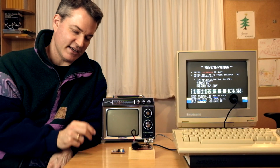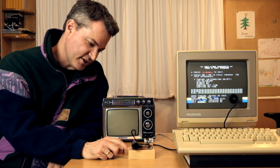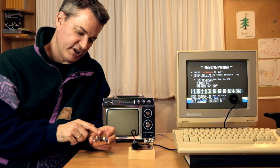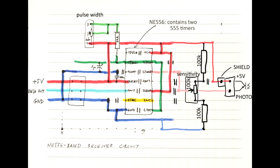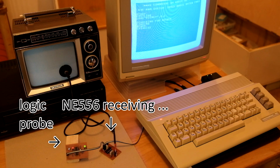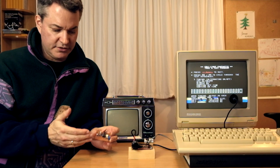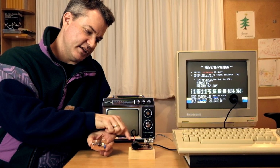There's just one thing I can barely forgive them. Breaking the first law of hobby electronics, their circuit design did not include the 555 timer. You might say that the 555 timer does not re-trigger, which is true, but I found a way to hook two 555s together in a way that just works perfectly for our purpose. The resulting circuit is even simpler than the original one in that it does not require the additional transistor.